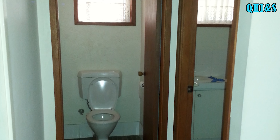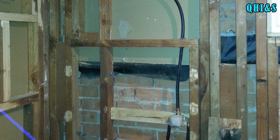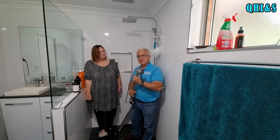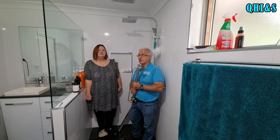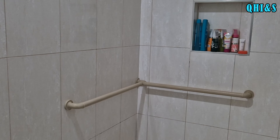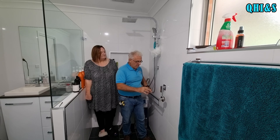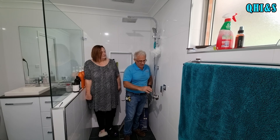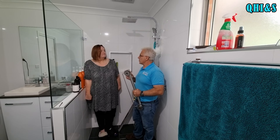This was a two-way bathroom — there was a toilet here and all the utilities were on that side. I took a lot of photos and know exactly where all the studs are, so we're going to have to find timbers. Regardless of your size — I'm just over 80 kilos, about 180 pounds — when you fall in a shower you have inertia and the pressure on a handrail is enormous. If you just use plugs in the wall, it will come out. You want to put handrails into timber.